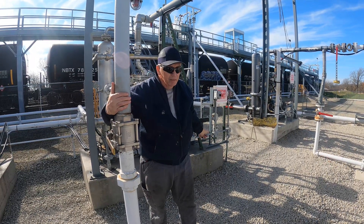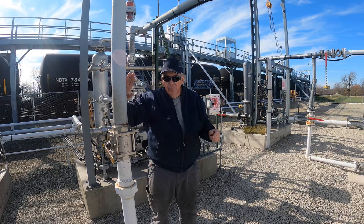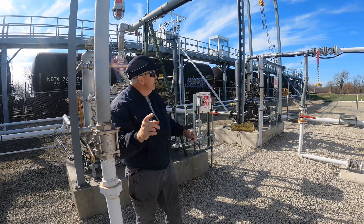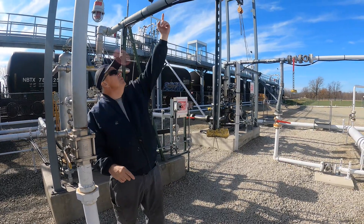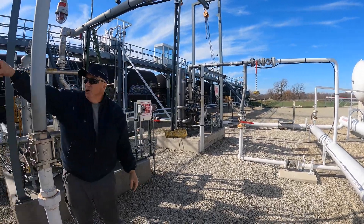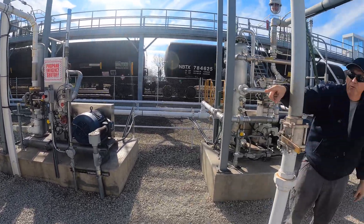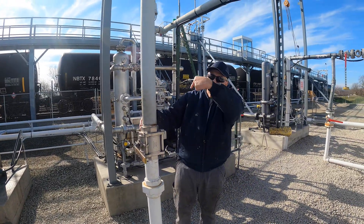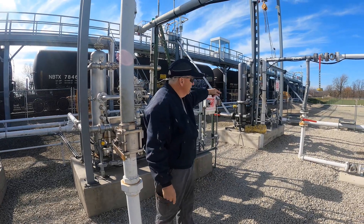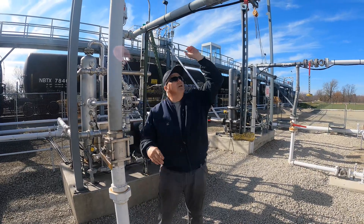I have a shuttle valve and this is my recovery line. This valve stays closed while offloading a rail car — I open this valve to let product come out of the trunk line and supply my compressor, while the recovery valve stays shut. Having the recovery line come straight out of the bottom is very helpful: if you get a slug of liquid come up your vapor line, it'll want to drop down that piece of three-inch pipe before it reaches the compressor.